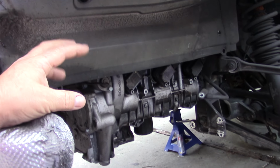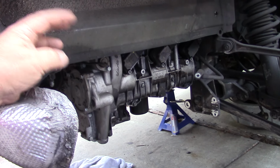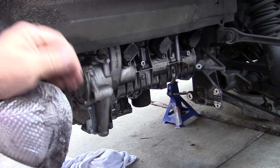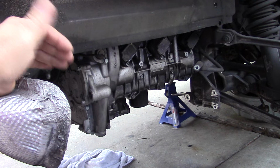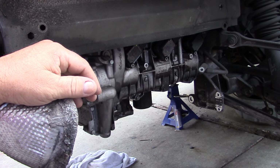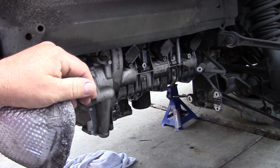I've also been told by a couple Porsche mechanics in my area that it's sort of rare that the heads crack, even though it's an issue. It's not an occurrence that happens a lot. And they also recommended to check the oil water separator and the oil cooler.